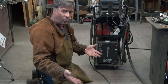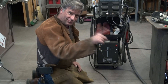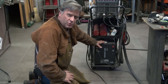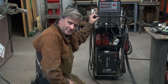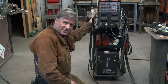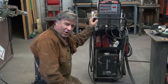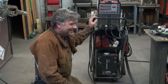If you run a water-cooled torch with no water for more than about 30 to 45 seconds, you start melting parts inside the torch — so you've got to remember to turn that cooler on. This cooler was about $450 new, but I bought it used on the Longevity Welding forum, in the for-sale section. A gentleman in California had it and moved up in welder model, so I picked it up for about half price. Perfectly good little unit — worked great, hook it up, been working ever since. So, does that answer your question? Yeah. Cool. Now let's get back to work.